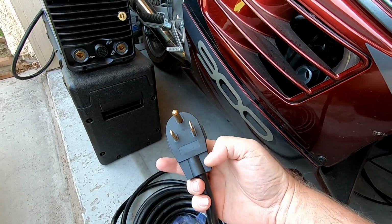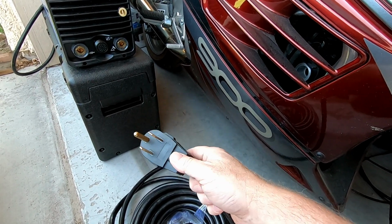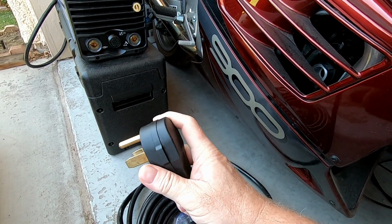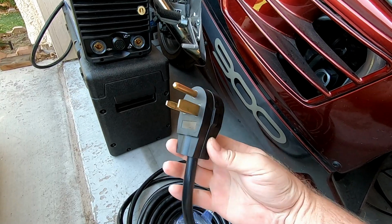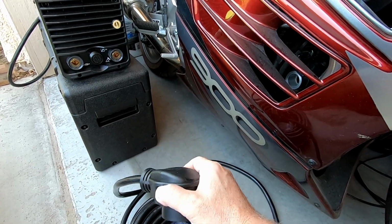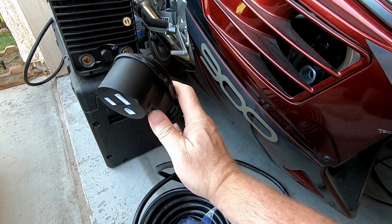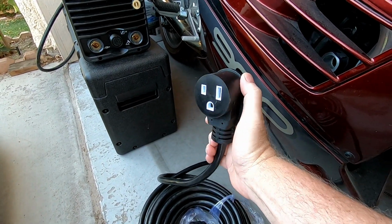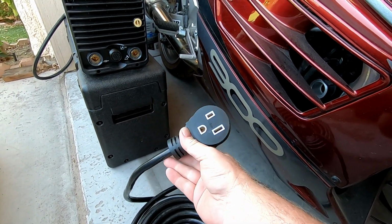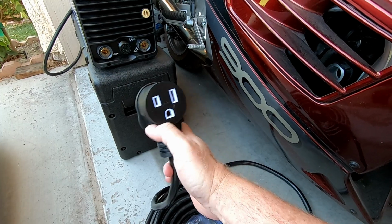At 250 volt, I can go 75 or 76 feet with the extension at 200 amps. So that'll get me back to the back gate and everywhere I need to be. And then for 110, 120 volt, it's like 272 feet, which I mean, 300 feet away. I was surprised it was actually farther, and then I reminded myself of my limited knowledge of electricity and impedance and all that kind of stuff. But anyway, this is cool. I'll show you firing this up.